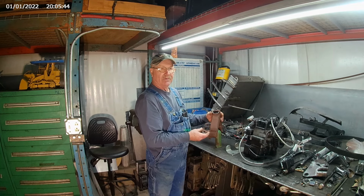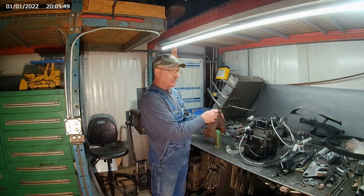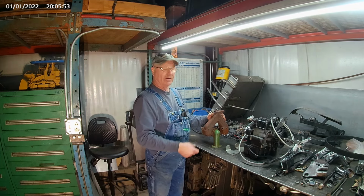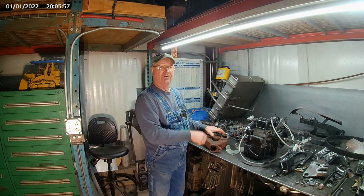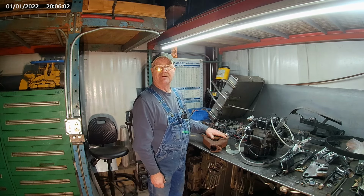Kind of like oven welding it. So once we get it hot and we get it brazed together, I've got a big bucket of oil dry over there and I dig a hole in it. When it's all done, I'll throw this down in that oil dry and cover it up with another bag of oil dry and leave it in there for a day.